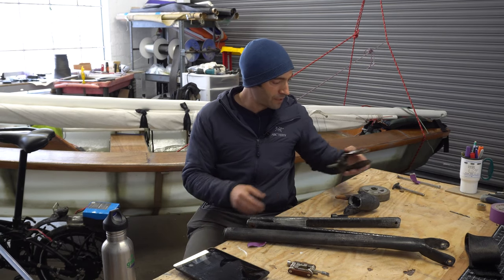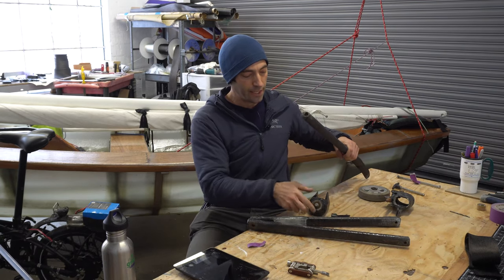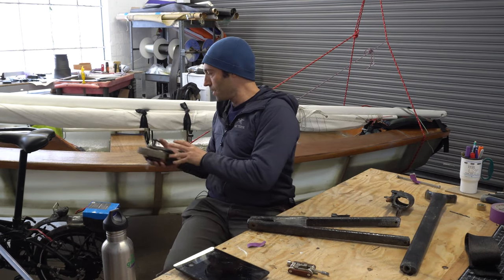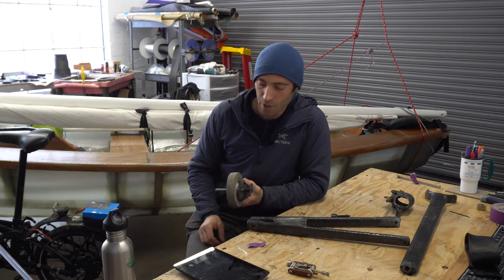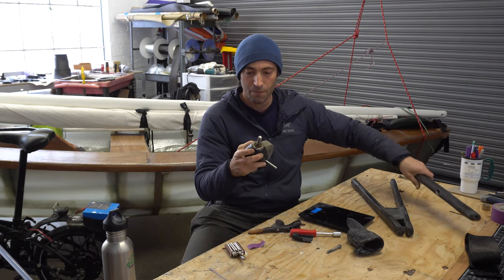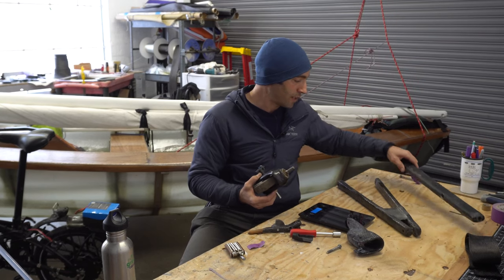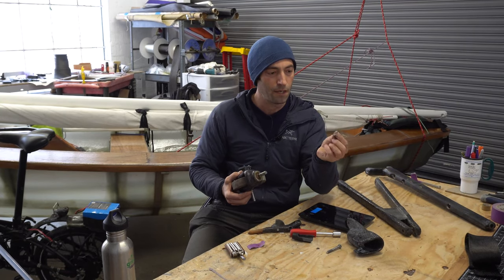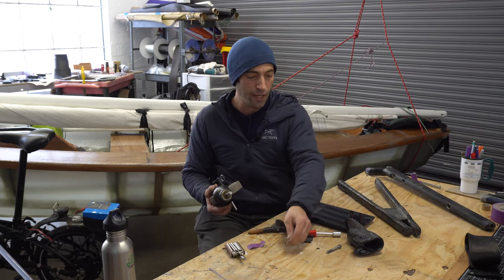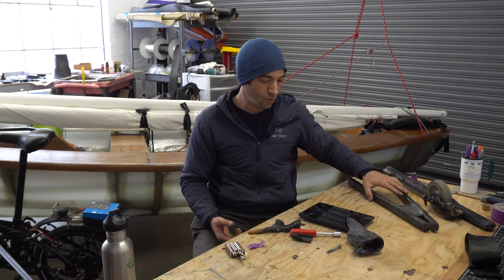In a previous video, I've shown the making of this caster. There are threads embedded in the end of the tow bar. And then that all drops into the electric bike, which I'm going to show next. Right here, this is a very vulnerable part of the system. It seems to be doing well. It's a half inch titanium bolt. I did notice when I was taking it apart that my aluminum spacer has disintegrated, probably from galvanic corrosion, and it's a struggle to keep this all performing well in salt water.